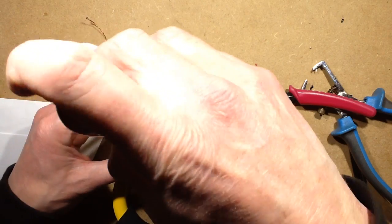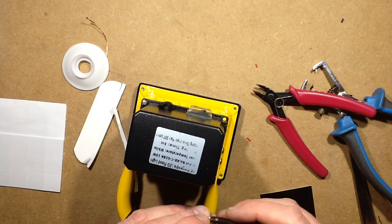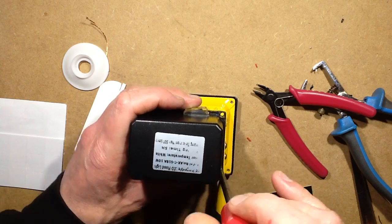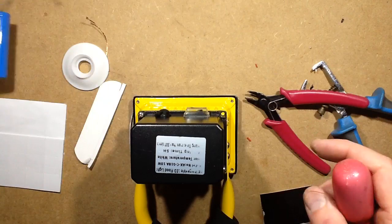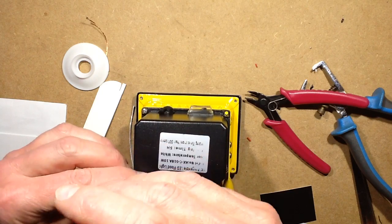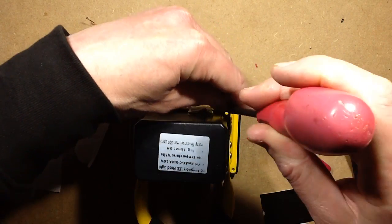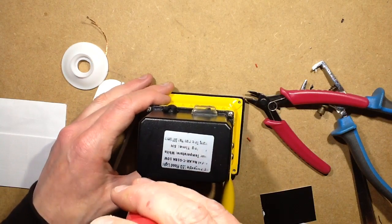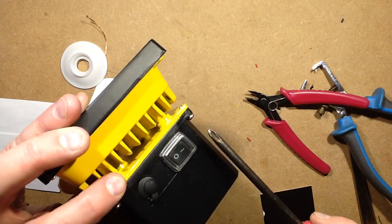And that proves that yes, with a bit of effort and with safety in mind, you can fit six 18650 cells in the back of this. For those who haven't twigged it: 18650 actually is the size of the cell — 18mm diameter by 65mm long. I don't know why it's a five-digit code; maybe it's designed to cater for cells that exceed 100mm, or maybe the zero at the end means it's measuring in tenths of a millimetre.